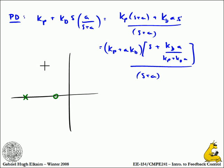The class that I took, we actually did it with op-amps, and trust me, anytime you start looking at compensation that's even a little bit more complicated than this, you're like, okay, I don't want to build that. Yes, much as I want just pure gain, I want to rearrange my sensors and my actuators such that pure gain gets me there. I can gain stabilize the system.